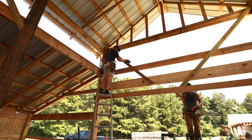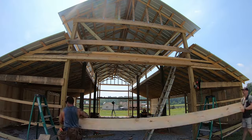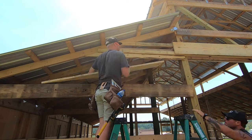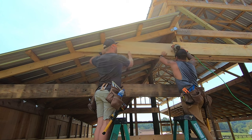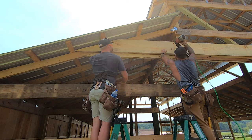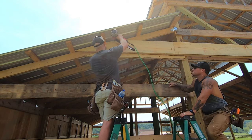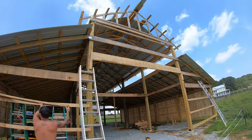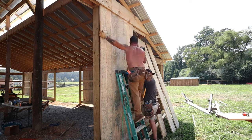Per usual I'm using the best saw on the construction site — a chainsaw — to trim them to length. This last board we're adding to our header is going to be the exterior fascia board, and it is spaced out to the same depth as the batten and trim will sit. Now we're moving to the back side of the barn and repeating the same process for the back header. With both headers installed, we can start running our boards on the bottom sides of the gables.